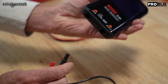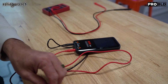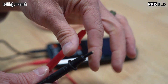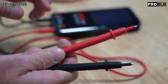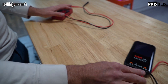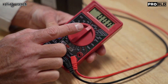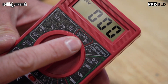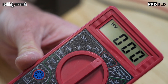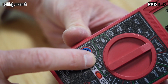Let me show you the automatic version — this is like the dummy-proof one. You just plug in the COM, plug in the input, and a lot of times you'll have little caps on the top which look like that. Just make sure you've got some exposed metal. So power it on and you'll see something that looks like that. If you look here, you'll see ACV — that means AC volts. This one says DCV — that's DC volts. And then there's this little upside-down horseshoe — that's ohms.